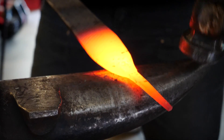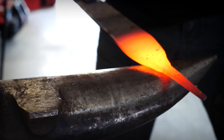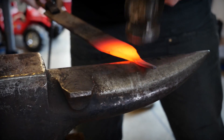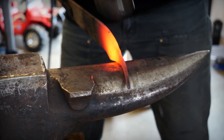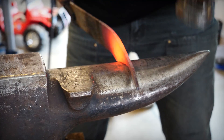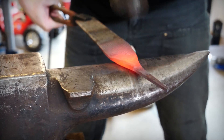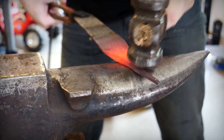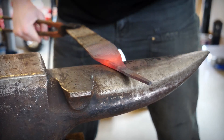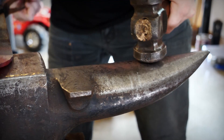With the material from the sides pushed more towards the middle and those corners forged in, we can begin to create the taper and draw this out. If you think about the steel in three-dimensional space, we're kind of squishing from the outside towards the inside, which causes it to bulge up along the outside. But that's okay because when we forge it out laterally and draw it out, that'll move that bulge laterally as opposed to outward, effectively making it narrower and longer.